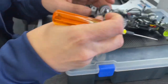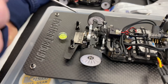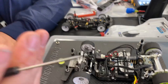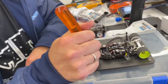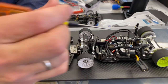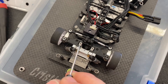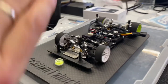Another issue you may catch on the pre-production prototype is that one ball socket is higher than the other. That was another problem with the early samples. We were initially just making one arm, but the tolerance difference is two tenths of a millimeter. What we ended up doing is making a left and a right arm — well, a one and a two. They're mirror parts, so you're going to end up with more precision. We also added a set screw to hold the hinge pin. The arms on the top pivot on the arm so they should be free on the arm, and on the bottom they pivot on the bulkhead.